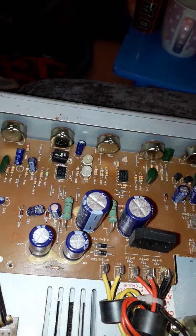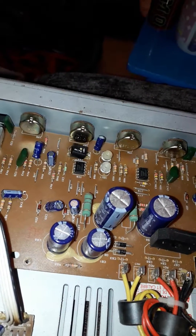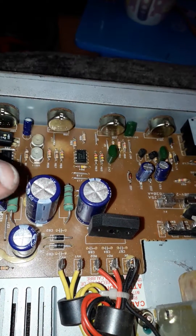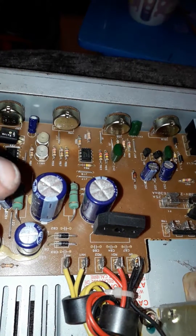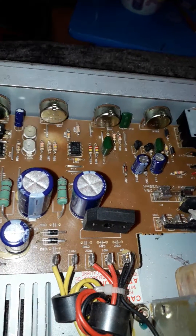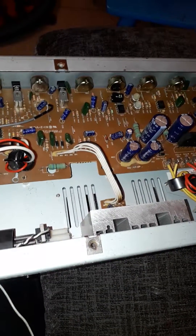If you're not used to working on amplifiers or opening them up, I would advise extreme caution. These capacitors here store power, and if you do happen to touch one of them there's a good chance you could get a serious shock — maybe even kill you. So do learn how to de-charge these if you're going to open an amp. Good luck and don't be afraid to subscribe.